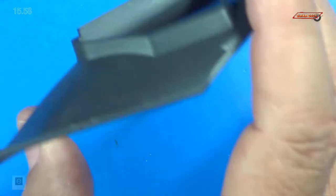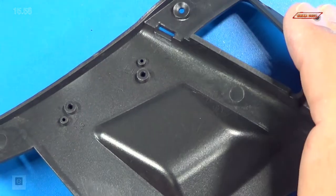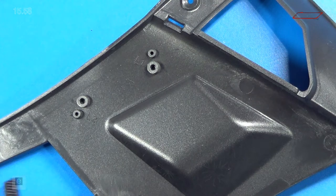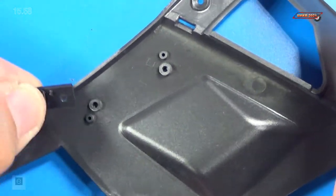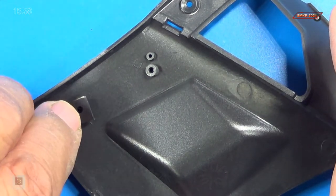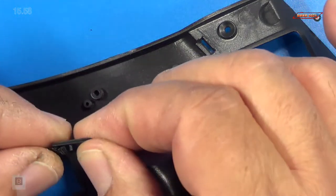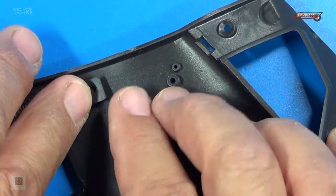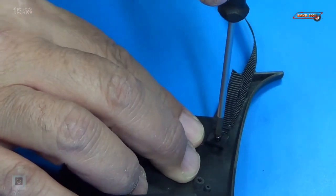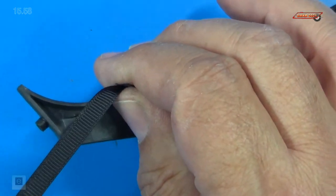Then we'll get our back panel and configure it like that. And it even tells you where L2 and L1 go. If you look there, it's stamped. So in this case, there's an alignment pin. Put an L2 in. And that goes down just like that. So, like I said, we're just going to line this up with the pin, just like that, and we'll put our GP screw into it. A little bit of resistance, and that's it. Once the GP screw is in, we'll feed this in through the back panel here.